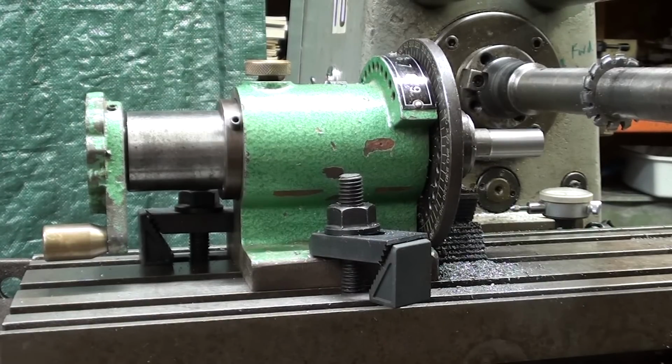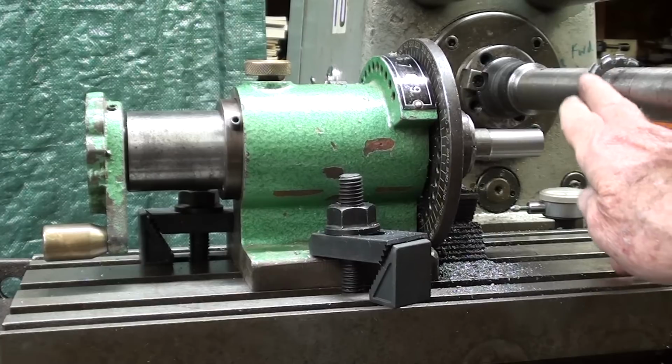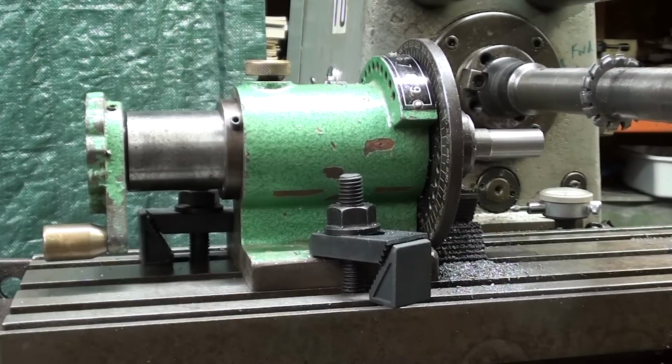I've already set the machine for a speed of 500 RPM on the spindle, and I'll have to run the motor in reverse because of the direction of the cutter. I'll be cutting toward the spin index. So again, that's reverse, and the speed 500 RPM, and feed is about 1 inch per minute, 1.06. I'll be using the power feed.